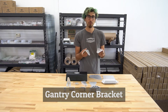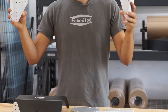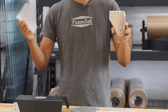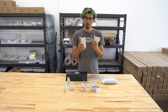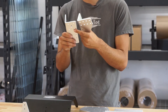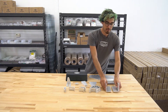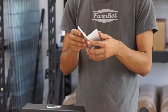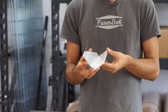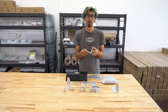These are the gantry corner brackets. There's both a left hand and a right hand version so they're mirror images of each other. These are mounted on the top of the gantry columns and then the gantry main beam is mounted in between the two, so these form the primary structure of the FarmBot gantry. You'll also notice the mounting hole pattern for the motors — we have the X1 motor on one and the X2 motor on the other. In past versions of FarmBot this component was actually two separate flat plates, but with the production kits we decided to combine these two plates into a single bent component because it greatly increases the strength and rigidity of the gantry.